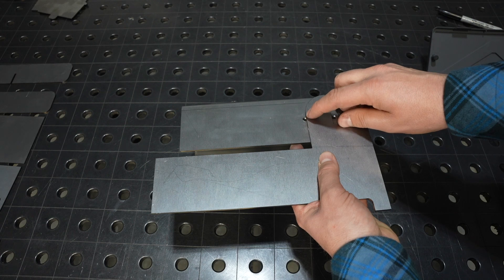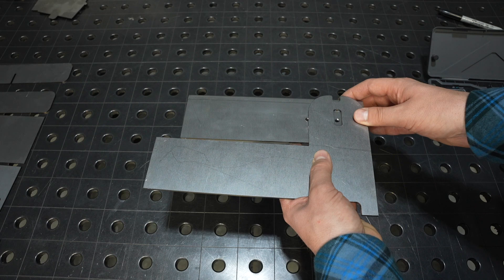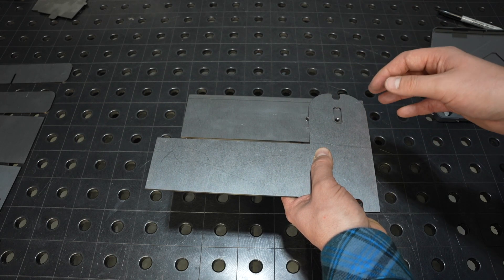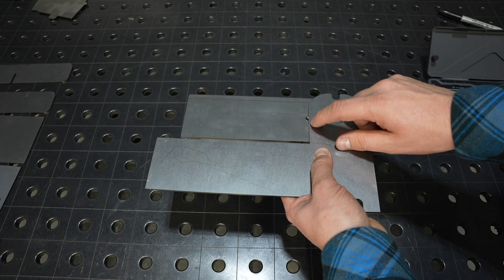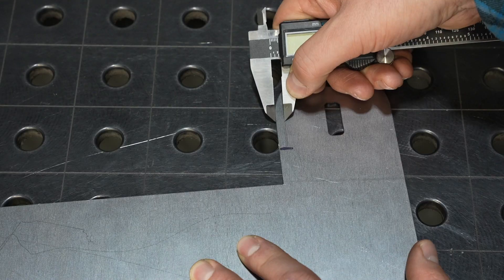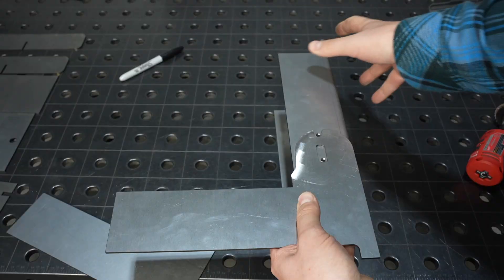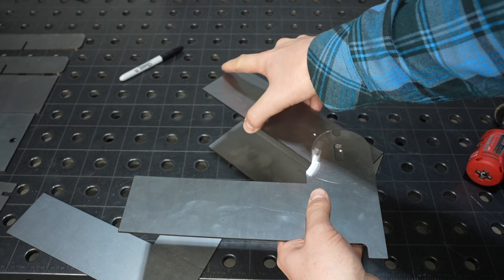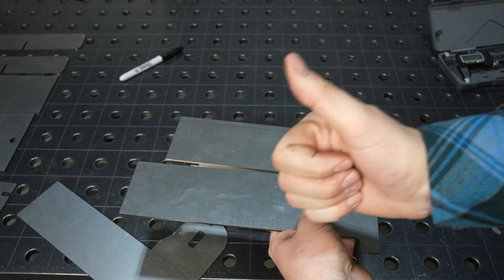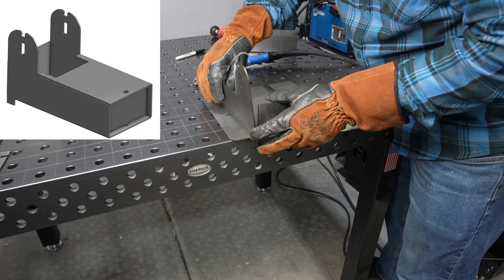Here's where I made an error — I didn't leave enough clearance for that pin as it folds up. This kind of thing can happen. I've designed a lot of parts and just because I make videos about this doesn't mean I do it perfectly every time. So we need to grind a little bit of clearance away right there.